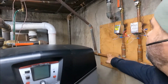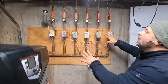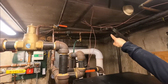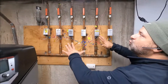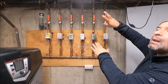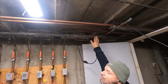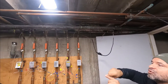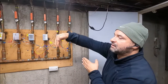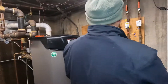This is the supply for the first floor — water goes from the boiler supply pipe, through the valves and controls, then branches out to six apartments. Each apartment gets one supply pipe, and once the water goes through the whole apartment it returns on a common return pipe. Each apartment's return connects to the main return line — I'll show you that on a diagram.